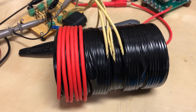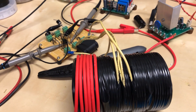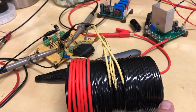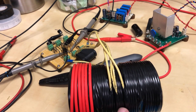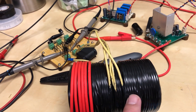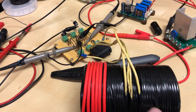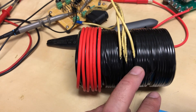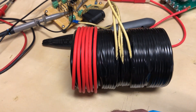The coil length is 16.2 meters, which resonates at a wavelength frequency of 18.5 MHz. Half of that — 8.1 meters — is about 37 MHz. I thought about trying a harmonic of that frequency, setting a harmonic here to see if I could get an effect by pulsing at a harmonic of the wavelength frequency. But that didn't seem to make much of a difference either.